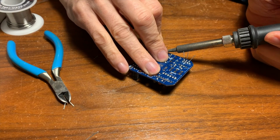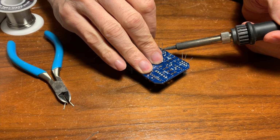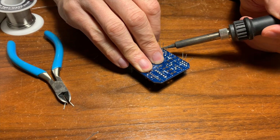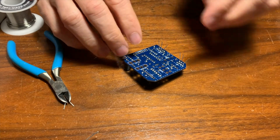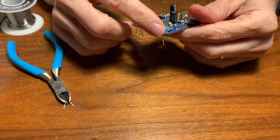Yeah, in this circuit, of the 2 transistors here, there's one at the very beginning that acts as a buffer, so it buffers your signal going into the circuit. And then there's one at the very end which acts as a follower, so it's like an output buffer, you know? And that's what these guys do right here.